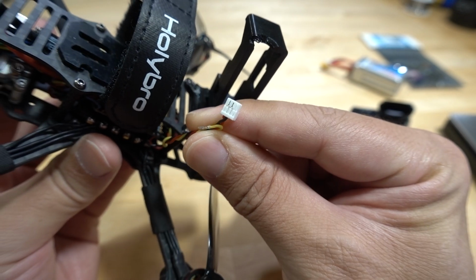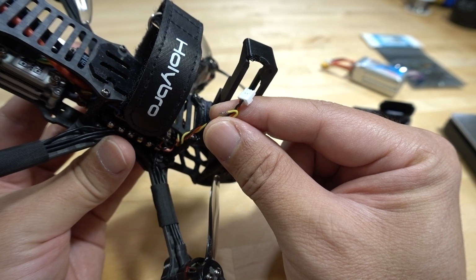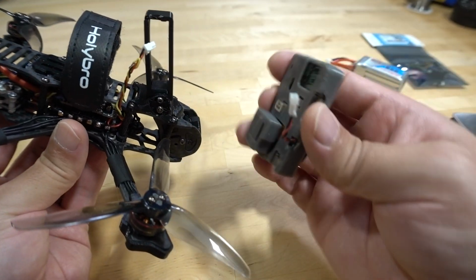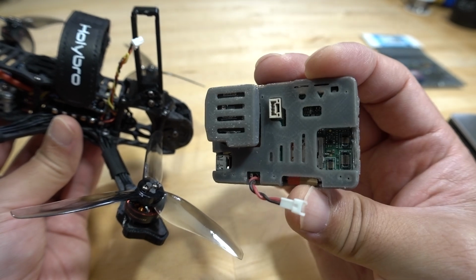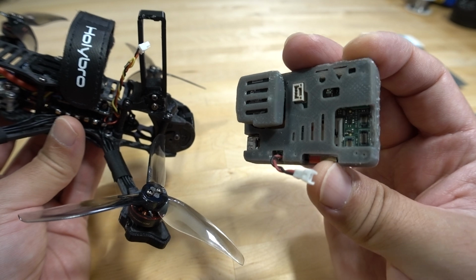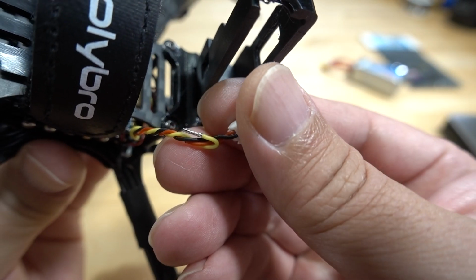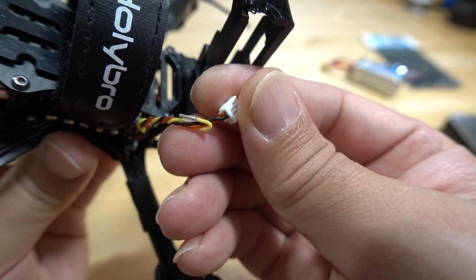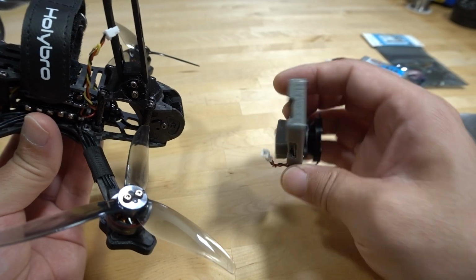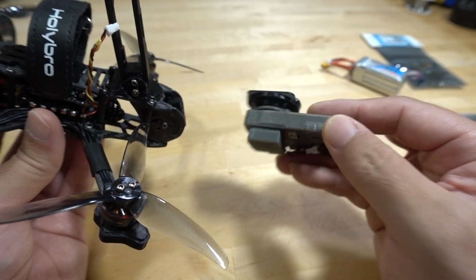That's the signal pin for, I guess, the remote recording capability, which doesn't work on my BEC board for whatever reason on this particular model. I've never gotten it to work on anything. So I just pulled the pin out, which is why you see it like this. If you can't get it to work, just pull the pin out and it'll work normally. Just power it up, and then you can use the power up and record buttons like normal on your naked GoPro.